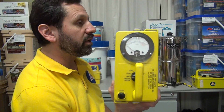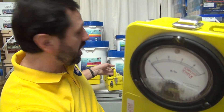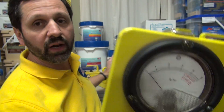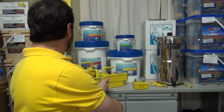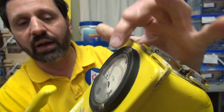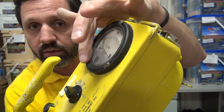Of the hundreds and hundreds of these I have, I have about a 40% failure rate. You know why? It's because of the dial indicator. This is one that has actually been replaced — you typically don't see this. But if you see one that's black versus one with a clear rim, notice the difference. One has a clear rim, the other has a metal rim. If it's a flat metal rim you're probably good to go, but if it has this little raised circular radius on it, you probably have one where the gauge doesn't work.